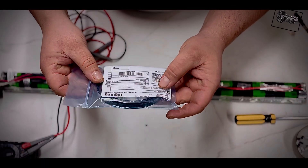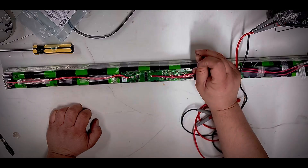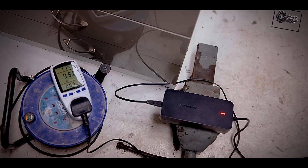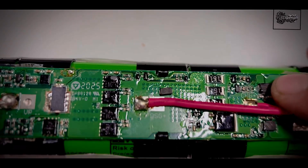The diode I found that works is the SMAJ40A. This diode will open the other side and spill into the negative to keep the voltage steady. The replacement diode is a bit smaller but works well. These two need to be changed. I still charge with an amp meter so I can see the wattage and make sure everything is right. These are ready, and those are waiting as well. To completely fix this, you need to take care of these two diodes.